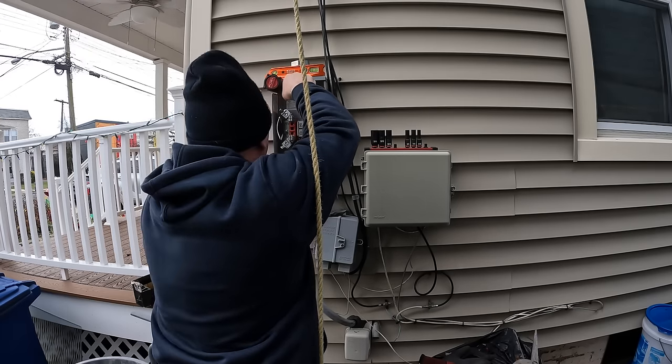And then once it's inspected, actually before I get inspected, I'll call JCP&L, the utility company here, and get what's known as a DR number. That's basically just a work order number, and we will alert them to disconnect this connection I'm making now, and they can connect directly to the number 2 aluminum, which you see in the upper right-hand corner of your screen. That's something I wasn't very comfortable doing off the ladder because I'd have to reach out, and so we're going to call JCP&L to get that done. But we won't be able to do that without a permit and a DR number.